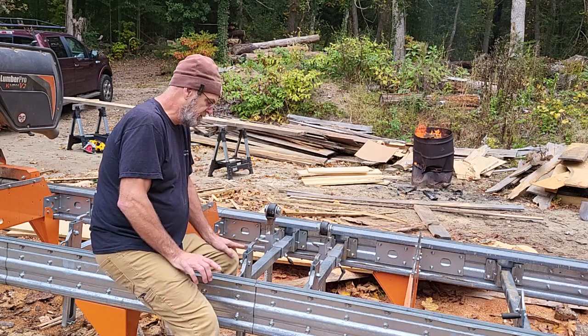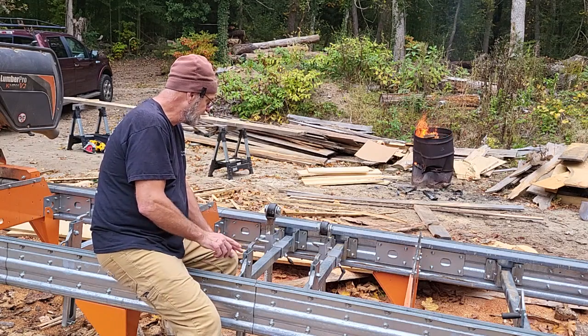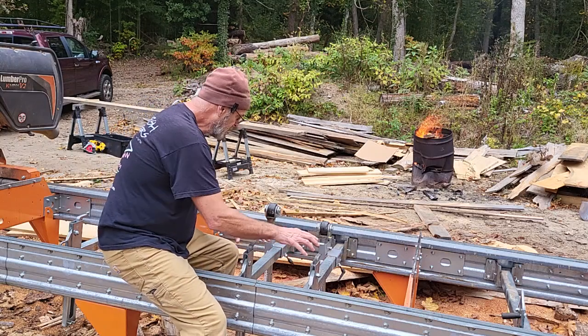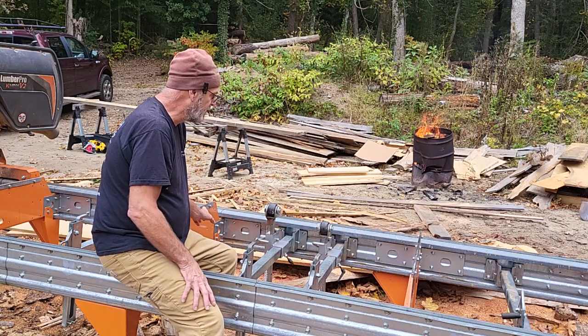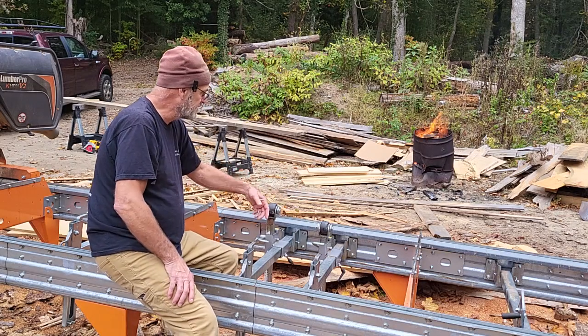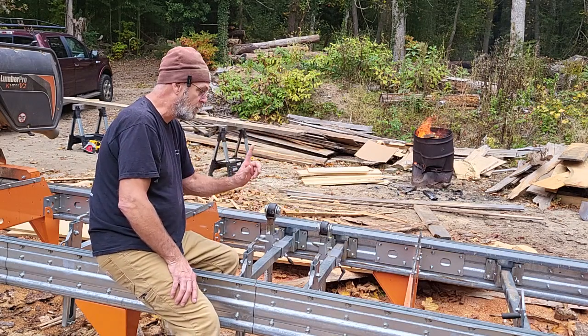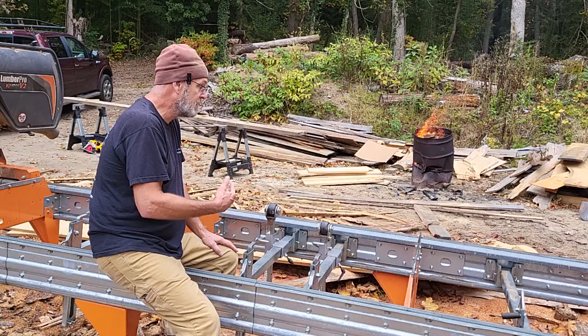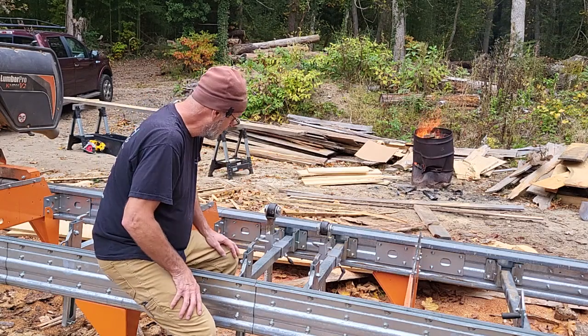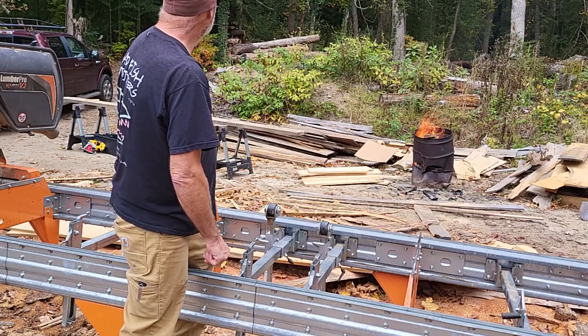Also the flexibility part is that I had to mill some small logs. So we put a couple of these in close together so we could use a four foot bunk for some little five foot cedars and we'd have two points of contact so they didn't twist out of the way — and that worked great. Now we're going to move these out for edging. I want to show you how simple it is.